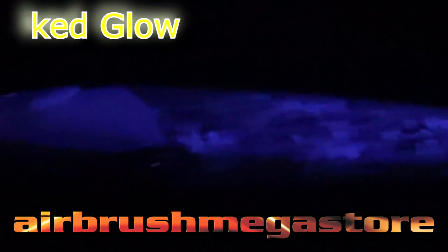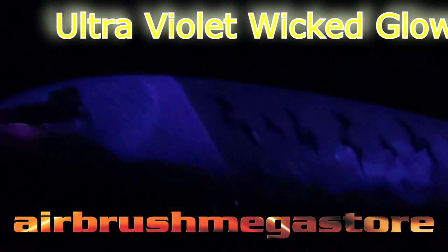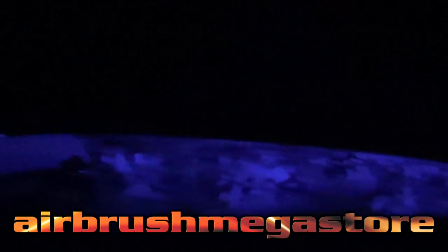Now if you go for a really saturated coat it is possible you can get bloom — that's going to be a white tinge because of the cold. I suggest you build up your coats medium to wet, and when you've got it to a stage you're happy with, call it done.